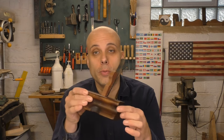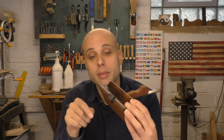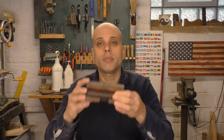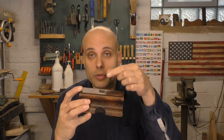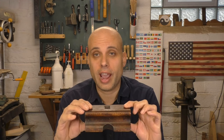Here's the vintage tool, and you can tell there is nothing complicated going on. It's a single block of wood with a cutter and a wedge. It goes through a mortise in the body and the cutter comes out of the mouth down here. The only complicated part is the mortise right in here — it's tapered, wide at the top and narrow at the bottom, and it's also angled at about a 60 degree angle. That makes it kind of tricky, especially if you're a beginning woodworker, and that turns a simple tool into a challenging build.